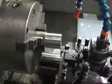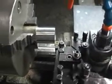I said I'd show you the lathe running. I've just taken a facing cut just to square off and measure and set the lathe. I'll set it up now — 49.9mm is the X diameter, the total outside diameter. Just give it about 0.1mm clearance for a thread to run on, because if it was 50mm and the internal thread was also 50mm, then you have an interference. It's going back minus 54mm. She'll stop and pull out 0.2mm and 0.4mm for X and Z just to give clearance and stop any chatter when it reaches the end of its path.